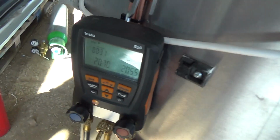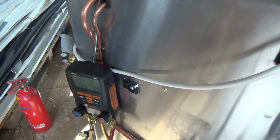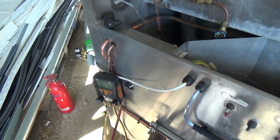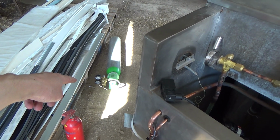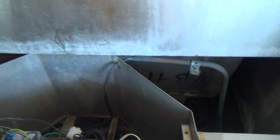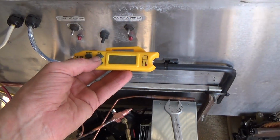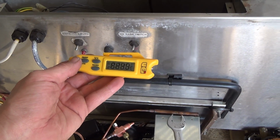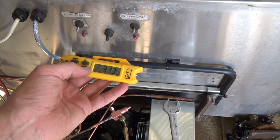That's on pressure test. It's dropped 1.5 PSI and then levelled out, so I think I started the timer too soon. Because either probably this tank's warmer than what the bottle was, or the other way round. This is quite hot here today. Well, hot for us anyway. 88, 31, that's in the shade.